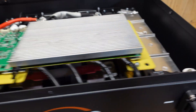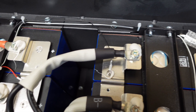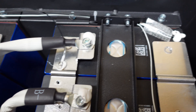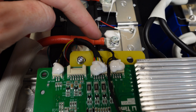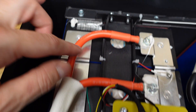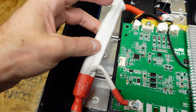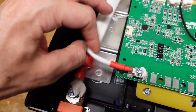That is a very large BMS — look how big it is. We've got four cells on each side here, so these are going to be 280 amp hour cells, which we probably could have guessed by the 560 amp hour rating. There is a QR code stamped on the cover of the cell. We have three temperature sensors on this battery: one going under the heat sink for the FET transistors, one going all the way to the right side of the case, and a third going to the upper left. Our positive conductor is a pair of five gauge silicone insulated wires with a 200 degrees Celsius insulation rating, protected in heat wrap back to the main lug. There is a smaller cable also coming off that lug feeding positive into the BMS.